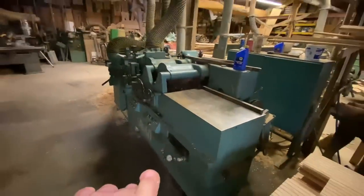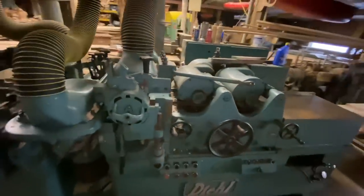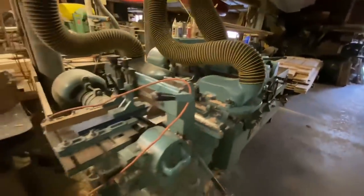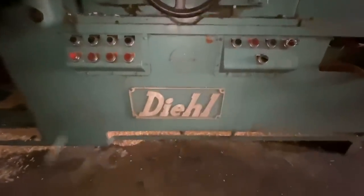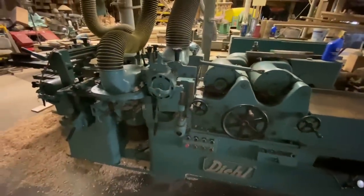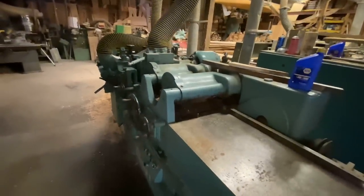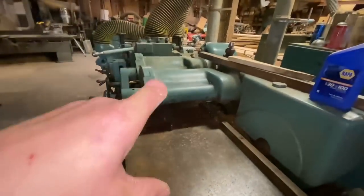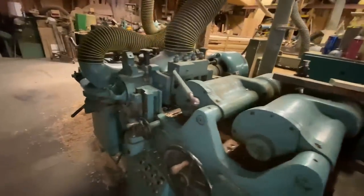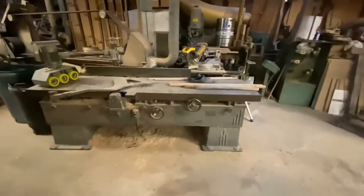The last machine my material went through is this molder head cutter - I want to say it's a six-head machine. It takes material off all four sides of the wood as it travels through. This is a monster machine - very big, massive, very old-looking and extremely industrial, not for the home shop. What it does is planes the top to final thickness, planes the bottom with the grooves, puts a groove on one edge and a tongue on the other edge, and actually makes a flat board become a piece of flooring. Tool envy is a real thing, folks.